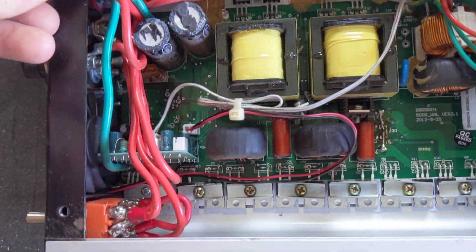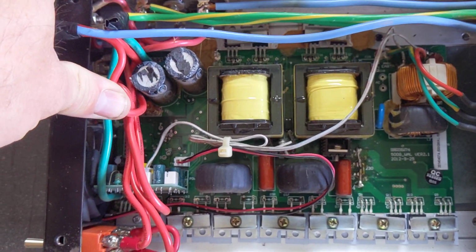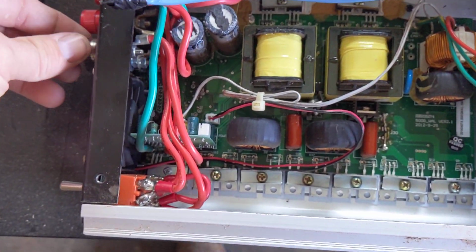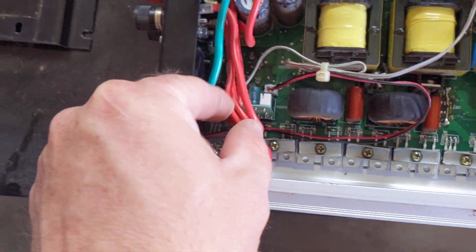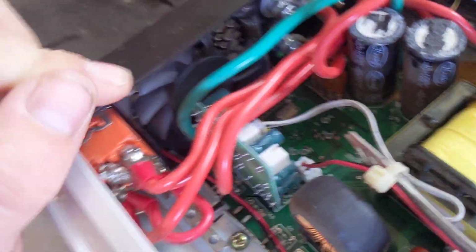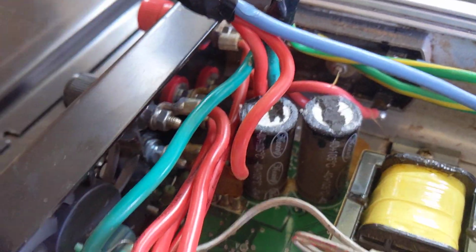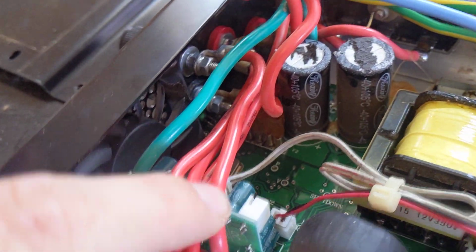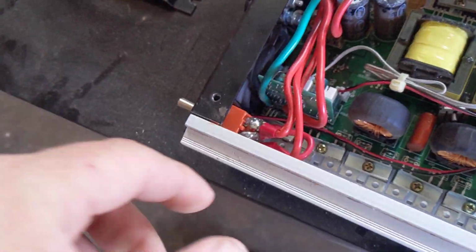Looking at the inside of it, though, just for anybody who's curious, try to open it up. It really doesn't look too different from the other inexpensive grid tie inverters that I've been using. It does have a brake switch that, all it seems to do is short. I want to say it shorts the three-phase leads, but it looks like, let's see. Nope, that goes over there. Yeah, that's what it does. It shorts all the three-phase leads.